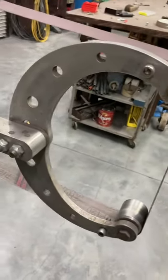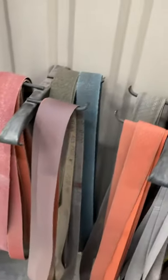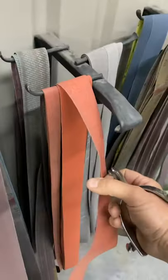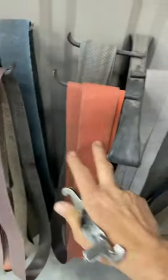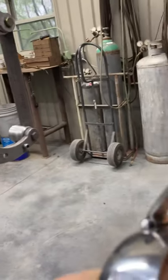I've got an X-weight paper on here, this is 120. I would start out with the 50 and then come to the 120. I might also come to a softer paper — this is a J-weight paper. You can see that it bends real easy compared to the stiff paper. It would make the contour in my spur a little better, a little easier to do.